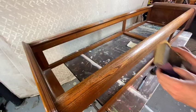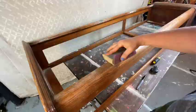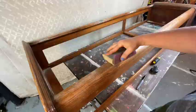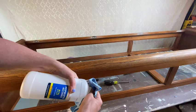Now we're going to go over the whole piece and give it a little bit of a scuff sand with 220 grit, then wipe it all back. I use regular isopropyl alcohol — not denatured — because that's what I had in the basement and I figured it would dry pretty quickly and leave a clean, dry surface ready for paint. I don't know if it was a good idea or not, but it worked.